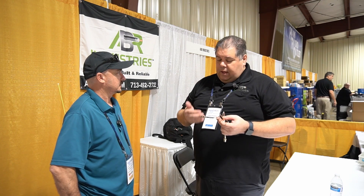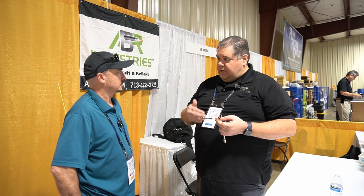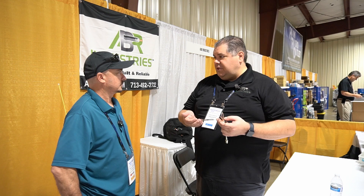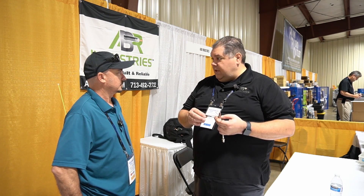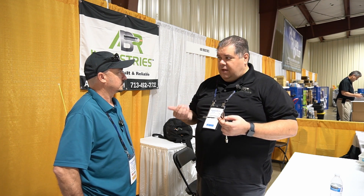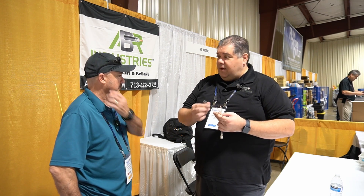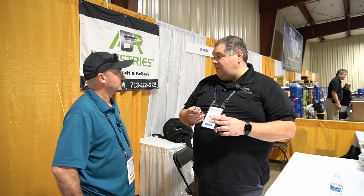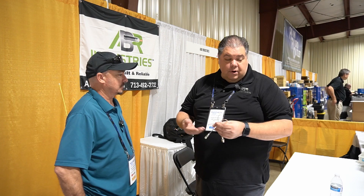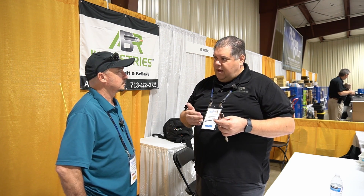It's an available option, and it'll all be highlighted on the web in the next week as we just released these cable assemblies. We're also going to do kits, so you can purchase a kit with a bunch of 3-foot assemblies or 6-footers and have a bag full of these different connection pieces so you can intermix any way you need to. For example, if somebody had an HT with an SMA but had an N-male coming off a pigtail and an antenna, it's an easy solution. You can also affix it with BNCs or any type of connector.